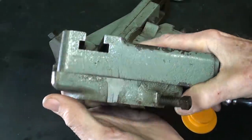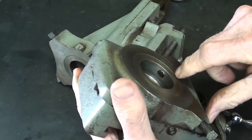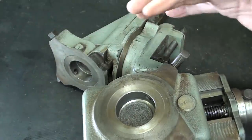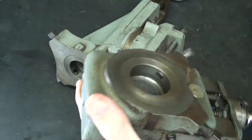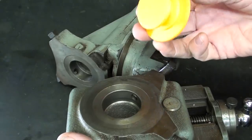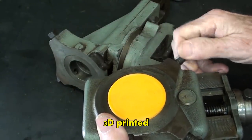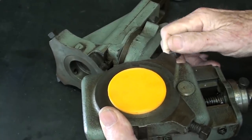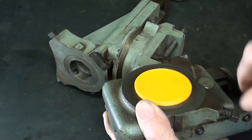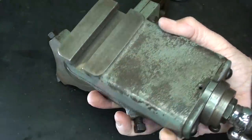And there are the specifications if you are interested in reading them. Here's the compound off the Atlas lathe. Now remember, there are a couple of pins in there. I don't think I'll take them out. They have an angle on the end, and we tighten these around the dovetail that's on the lathe. It's very easy to lose those. So a man, and I'm sorry I forgot your name, made me a couple of these, which can be put in here as a keeper and then just snug this up. When you put this away for a period of time, snug those down and you will never lose those hard-to-find pins.